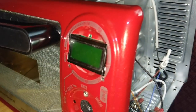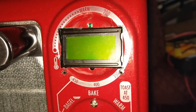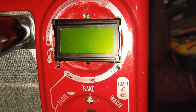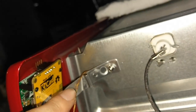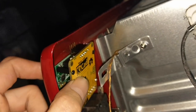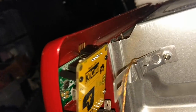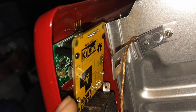The screen will sit somewhere in there like that. Using a file now to clean up the sharp edges and get it to fit a little nicer. Got the screen cutout done. I've got two holes drilled at the bottom to mount up with the LCD — that'll be the main way the screen is held on. With those two screws it should be fairly firmly mounted, then I'll just bend this part so it presses against the board for extra upper support. I'm putting some electrical tape on the LCD pins so they don't short against the case. If you notice, I've got a right-angle header adapter on there — the USB port is too close to the side of the oven to actually plug anything in, so we're going to do this the manual way.